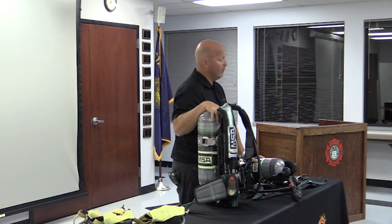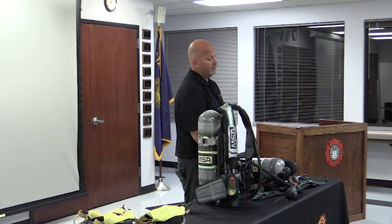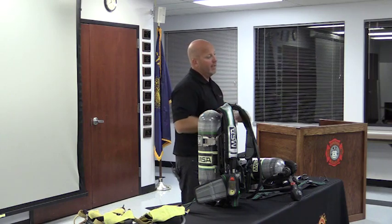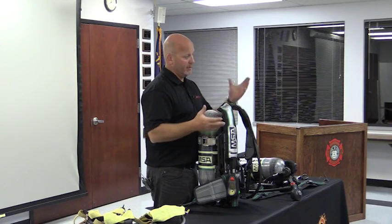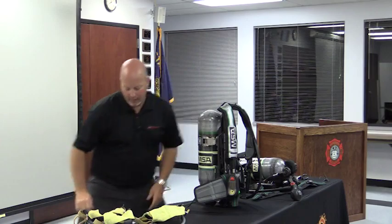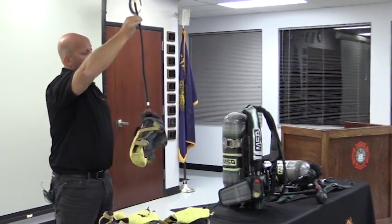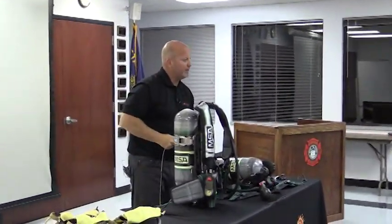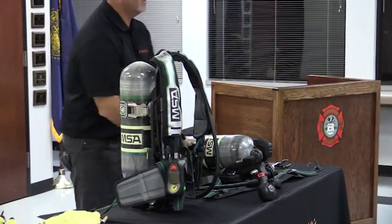Yeah. So you don't have a quick disconnect on your SCBAs. You don't have the ability to disconnect, connect, and all that, except for the ladder truck packs, which I was going to go into right now. So, thank you for the lead-in. There is a quick disconnect on the second stage hose, so I can take the second stage hose off. But on your standard breathing apparatus, I have nothing to connect this hose to.